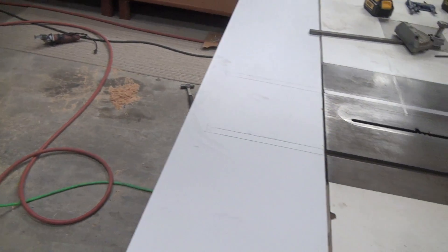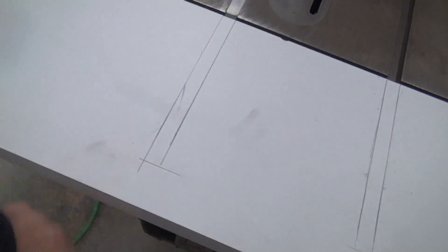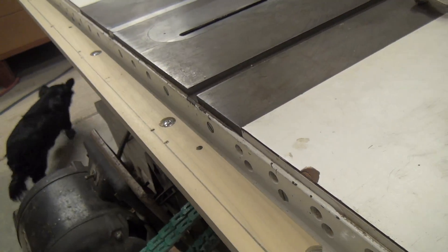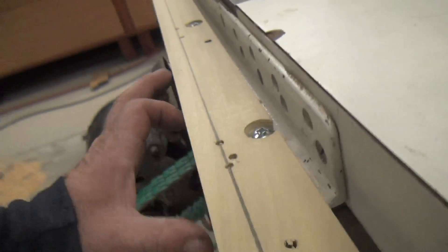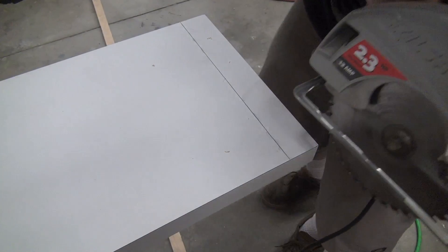The outfeed table is also going to be a workbench. I have it just sitting here — it's mocked up, it's pretty strong. I'm going to have to rout these grooves in and cut this off. I took a piece of two-inch white poplar and planed it down to the height that I needed. I used part of the Biesemeyer L-metal, or angle iron, and fastened it with some bolts going down the line. I'll cut it backwards to avoid chipping the laminate.